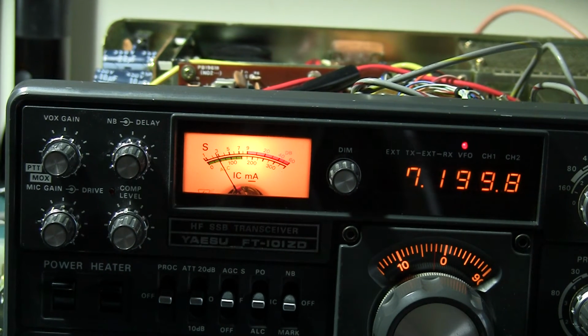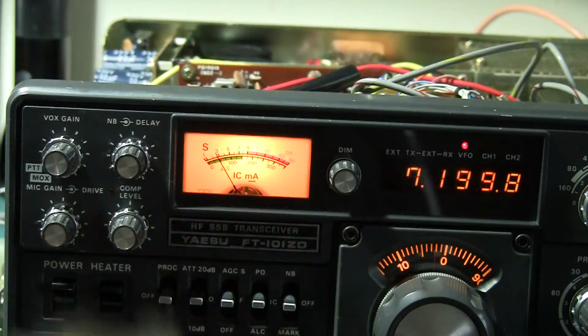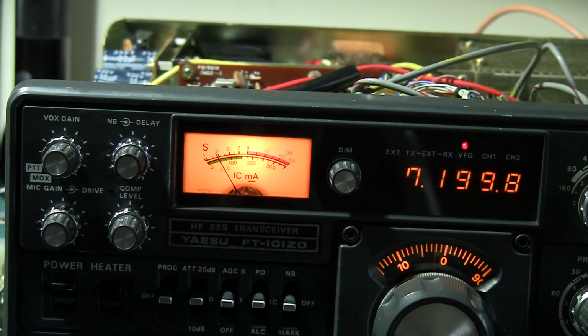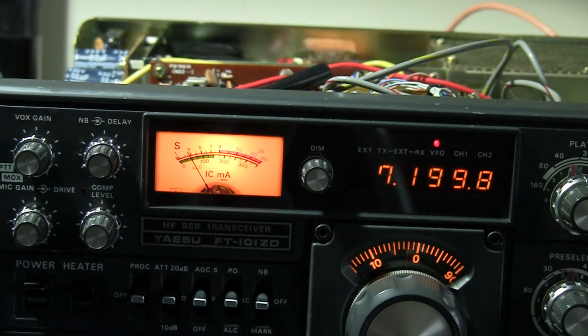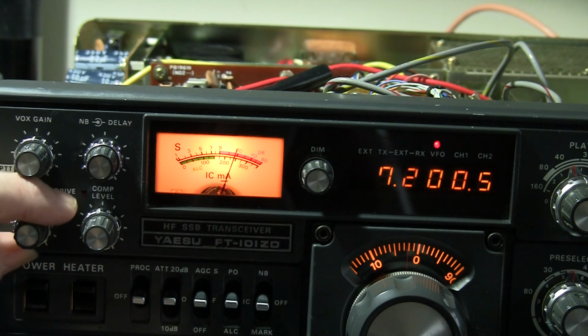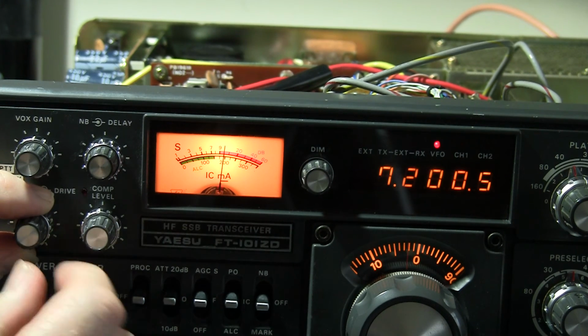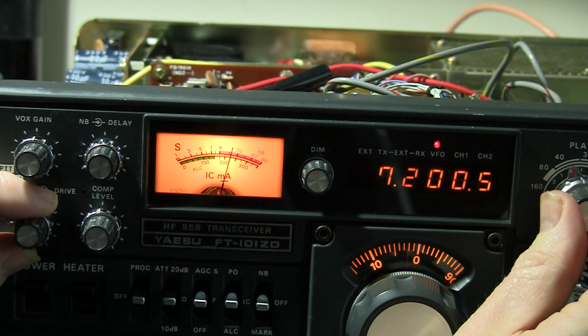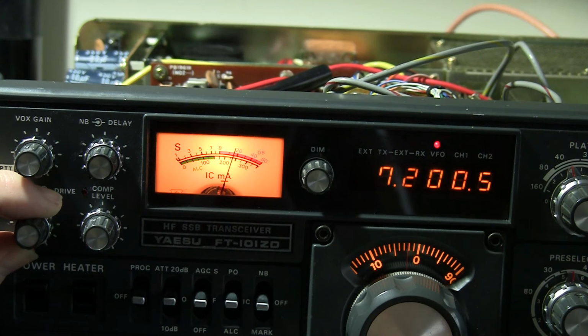And I've noticed while I was tuning this radio, as I dip the cathode current, that corresponds quite nicely with maximum power output. So we'll just do that one more time here. You'll see what the cathode current's doing. I'm not sure I can get them both in the same shot actually. We'll just see here if we can. No, not really possible from this angle. So we'll just go into tune mode, and we'll just dip the PA current. Yeah, and it corresponds exactly with maximum power output, which is just right. Okay.